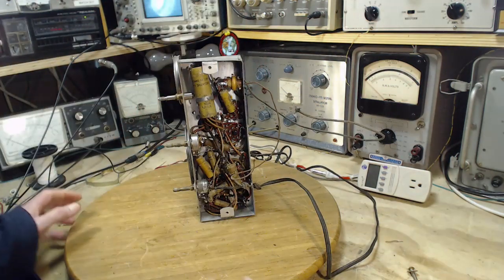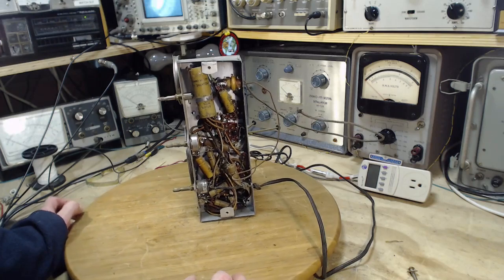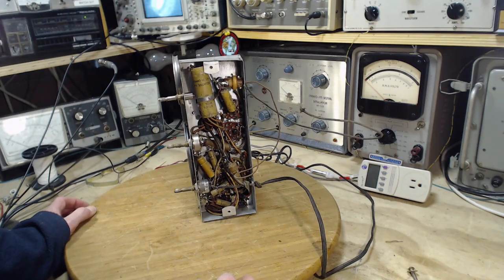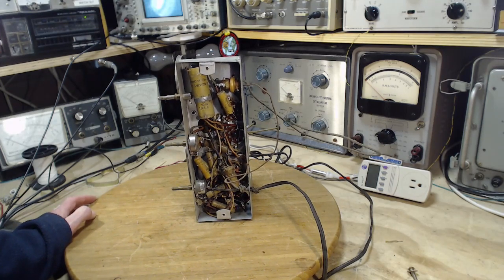Oh, okay. Not much done under here. Full of stuff. Oh my gosh. It's a dirty actor. Full of ugly wax capacitors, all thoroughly ugly wax capacitors. Why would I even bother starting this radio up at this point? Only for the fun and pleasure. And this big power supply capacitor almost certainly shot. Lots of work in here.